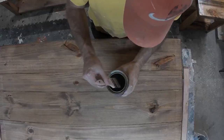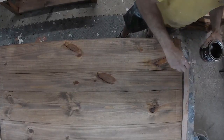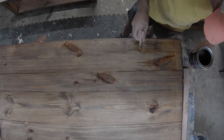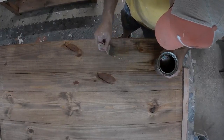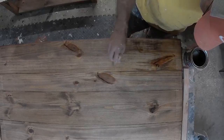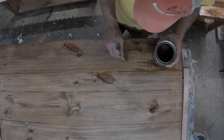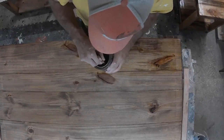This is the polyurethane finish I'm using. I'll use three or four coats of this. After the first coat dries I will sand it with 120-grit sandpaper, put another coat down and sand again. I'll sand between each layer because the polyurethane raises a little bit of the grain, and lightly sanding over it takes that out. After the final coat I'll sand one more time lightly with 120-grit, then it'll be ready to attach to the frame underneath — the stool frame I built separately — and pocket-hole it to the frame.